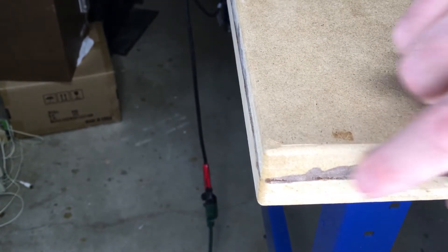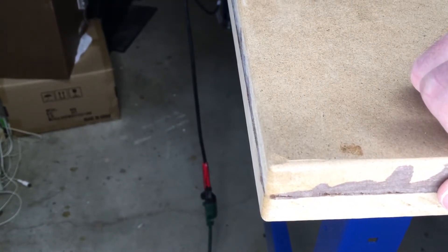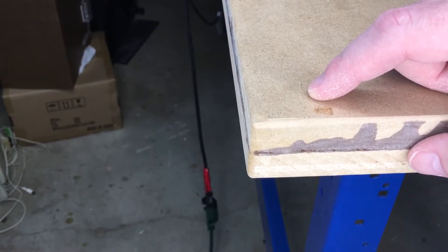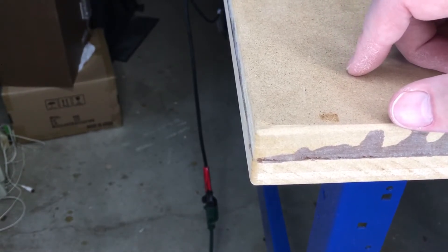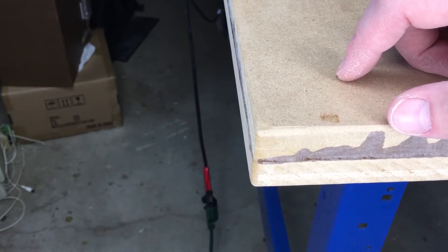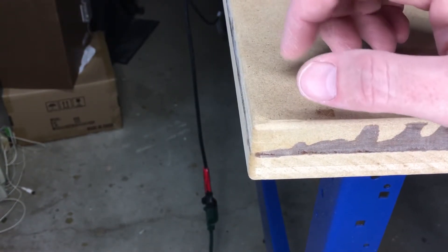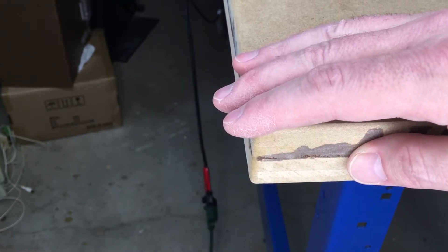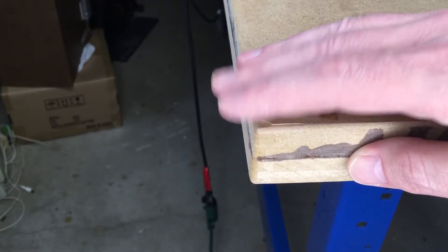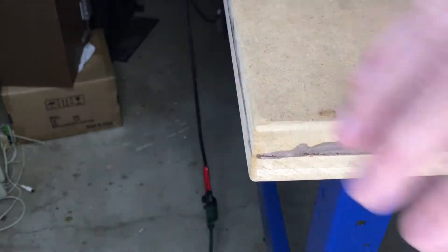Next I need to sand this a little. It'd be hard to sand all the epoxy off, but if I get it smooth I can put finish on it. One of my goals was to have a bench where I could drill a hole and not worry about it — this piece of MDF was around $27, so if I screw it up I can always replace it. If you don't have all these tools, home improvement stores can cut MDF for a fee, maybe a dollar a cut. You could buy two pieces, have them cut to the same size, and glue or just screw them together, then screw them onto the base. To round over the edges, you could use a little sandpaper instead of a router.